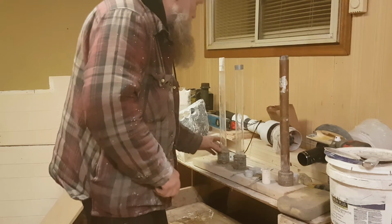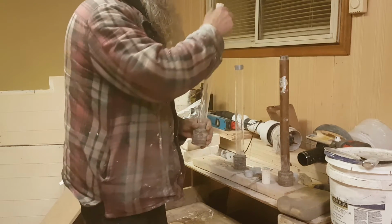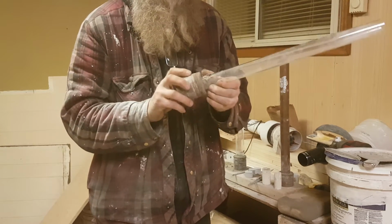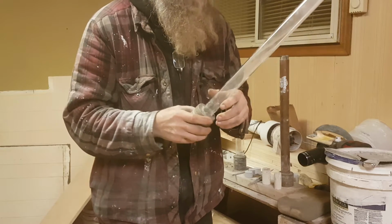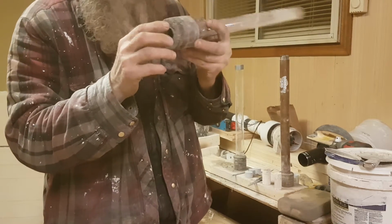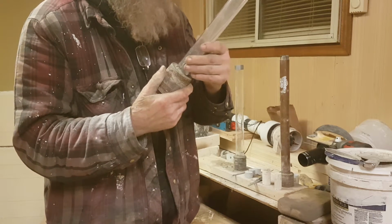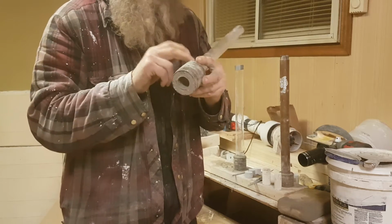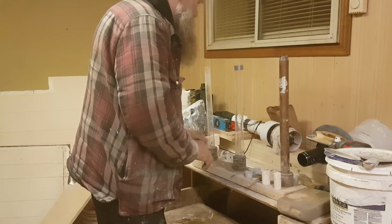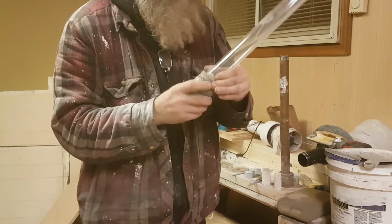So today I've been working on, I think I can pull these out, they're dry. Making some new pipes. This is a refractory cement that I've used to kind of lock the pipes into the 2-inch coupler. And the reason I use quartz is I can actually see the visual operation of the flame on the inside. So these are turning out good. This is a 1-inch clear quartz. This is 1.5 inches. Very, very expensive to buy.